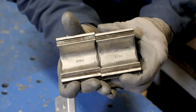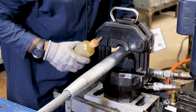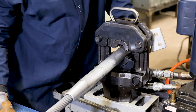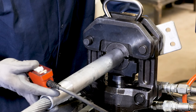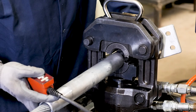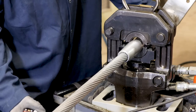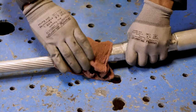Mount the AH die set specified on the aluminum splice body in the press. Lubricate AH die faces and the dead-end body between the set of neutral marks nearest the steel eye end with lightweight oil or clean plastic wrap material. Continue compression, overlapping each crimp by an amount necessary to prevent the formation of ridges between adjacent crimps, and ensure complete die closure with each crimp.